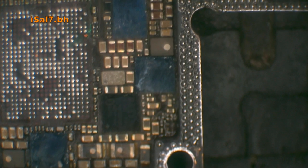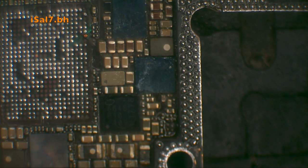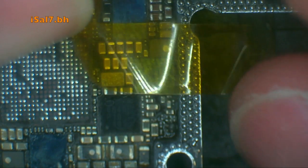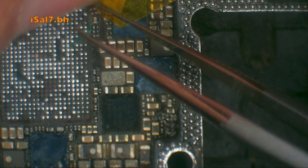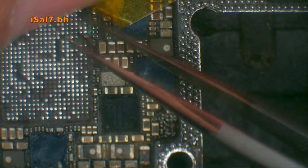It's right in the corner, so it's very difficult to get the right angle and put back the EEPROM. At some point I think the airflow was so high that it blew off, and I had to look for it for about 10 minutes until I found it. But it's essential — if you don't have the EEPROM, it will not boot up.